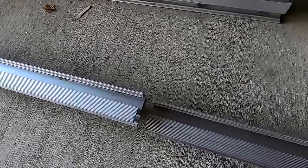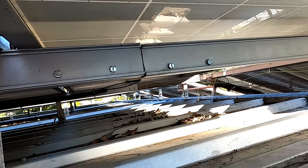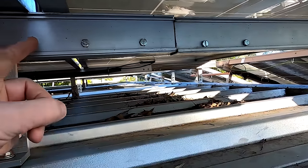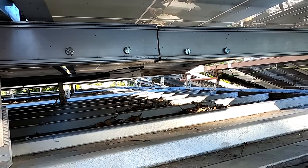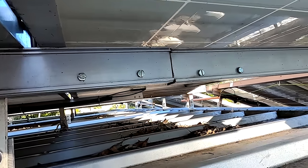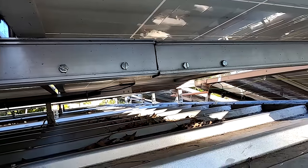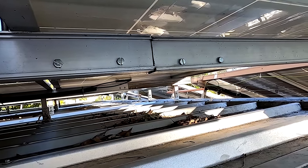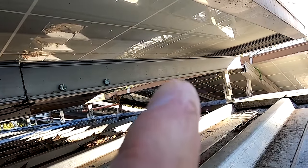I really don't see the point. Here is one of my self-made joiners - you can see the two screws and how far the aluminum bar sticks inside this rail system. There are star washers on the other side which really pierce into the material, and I think this is a far better joining in terms of electrical contact than the joiners provided by the manufacturer. But these ones will get only one earth lug.